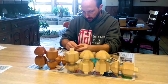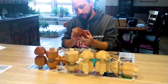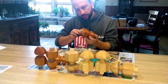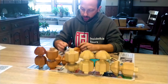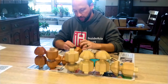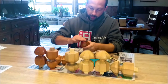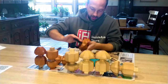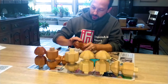It did make it a lot easier to have the linseed and turpentine heated, but I did feel that that's considerably more dangerous. While turpentine doesn't have a self-igniting point until over 400 degrees, it does have a flash point under 100 degrees. Now, a flash point being if it comes into contact with an open flame or a spark or something else, the vapors can begin a fire, can ignite. So if you are using turpentine, you do need to be especially careful not to have any potential flash points in your shop.